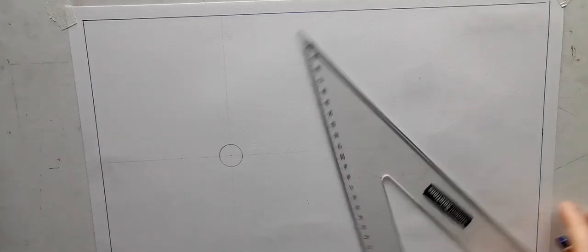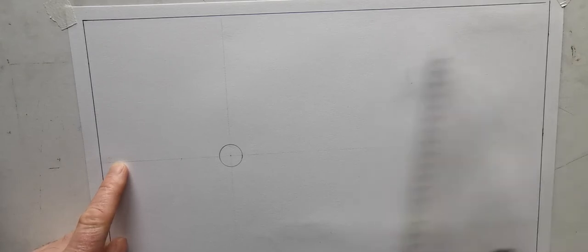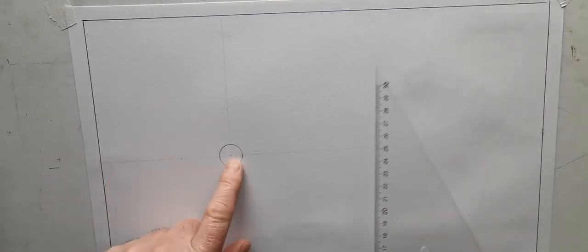Okay, so look, just to get started here, what I did was I came down 120 because the biggest radius is 100 and I came in about 120 so that I've just got a bit of room, but I want to leave space over here for my follower displacement diagram. So I just came down and in 120, drew the camshaft there, which is 20.